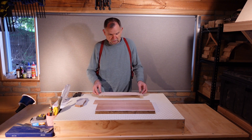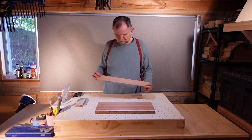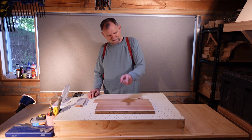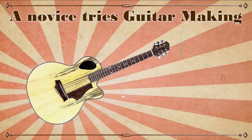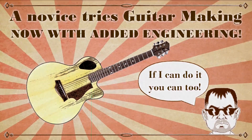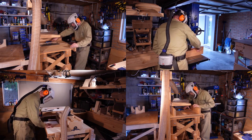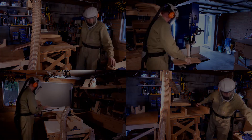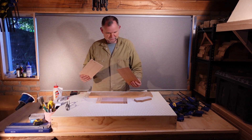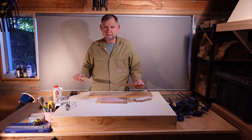I found from previous projects a couple of pieces of veneer pretty much of the right thickness, but I thought this piece of black wood is just a little bit too plain for a headstock, so I'm going to take this one which has some nicer grain. Let's get that down to dimensions. After all of that, and a little bit more that I didn't show you, we now have two pieces of veneer — some celery top pine and some black wood — so now we're just going to laminate them together.